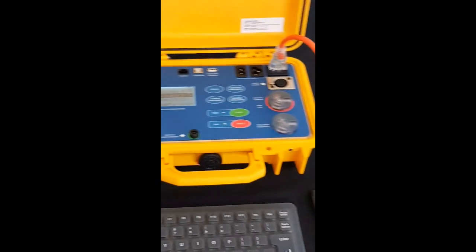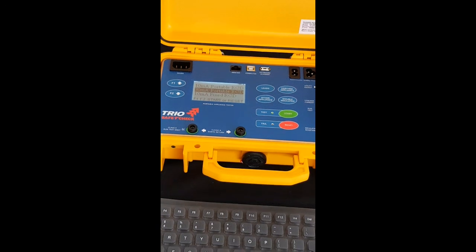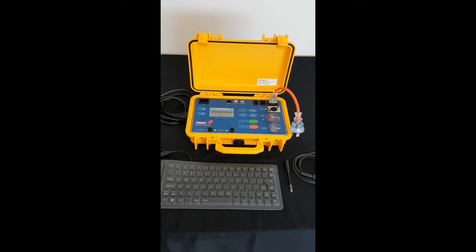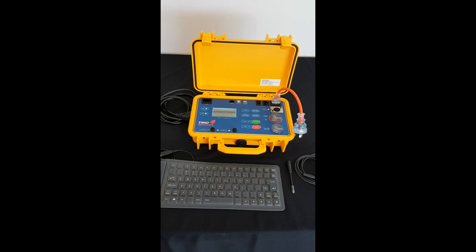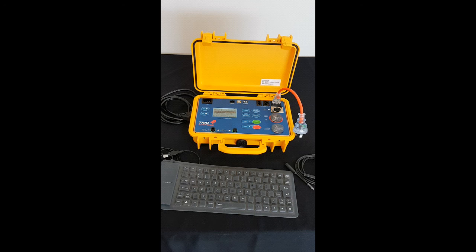You'll also notice on the front of the tester that you have an extra earth return socket. For safety reasons this one is specifically targeting the class 2 run tests — we can cover that in a later module. You'll notice on the front of the tester you'll see a keyboard. What you're seeing here is the actual standard kit. If you're using data logging or want to use data logging, the data logging feature can be activated through pressing the F2 menu. In activating the data logging mode you can actually type in information when prompted, and you can also control the front interface of the tester via the keyboard.